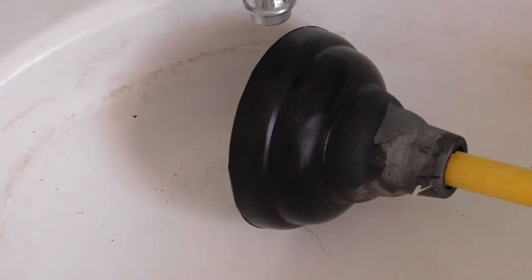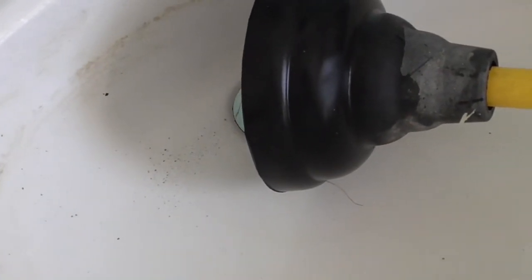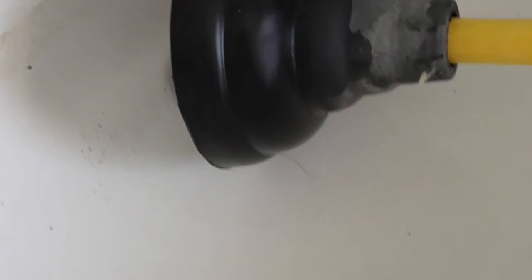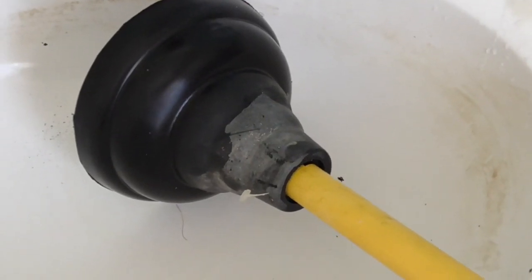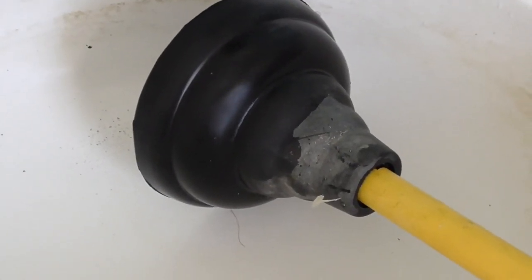Follow-up: I've been working on this sink for about three hours now. There's a plug in the pipes — I have to run the water for about a minute before it plugs up. So like I said, the house is really old. You can see all the dirt coming out of the pipes. I just wanted to be honest — it doesn't always work. I've done the baking soda and vinegar in the drain and that's helped a lot. I've been plunging on and off for the last hour with hot water and the water finally drained down. I'm going to pour some more hot water down one last time, but I've got to call a plumber because sometimes you just can't do things yourself. I can't even snake under the sink because I can't get a snake into the pipe — it has a bad angle. Sometimes you can do things and sometimes you just can't.